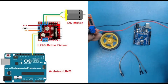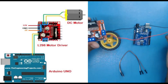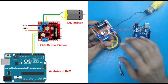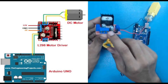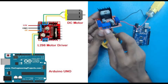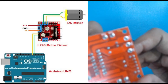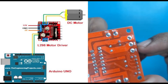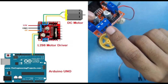Now the motor has been connected successfully with our motor driver. Next we need to connect this motor driver with our Arduino and provide the power supply. For power supply, we are going to use the 5V for that area and provide 12V as well as ground. Looking carefully, you can see the 12V pin and the ground pin — we need to connect both of these to provide the power supply.